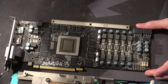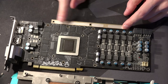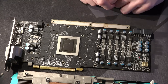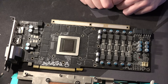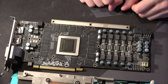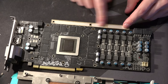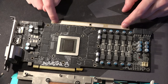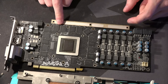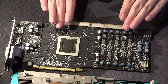The first thing that's kind of special about this PCB is this tab up here. This strip is basically exposed ground plane, and the idea behind doing this is that you can sink heat through the PCB — because the PCB is a fiberglass-copper sandwich — so you can sink heat through the copper ground plane of the PCB into this strip up here.